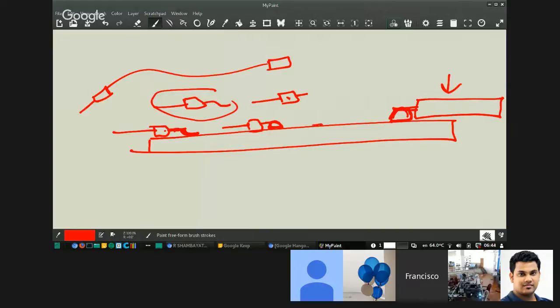And remember, if this is the pad and this is the component, never do what some people do: they solder it like this. Never solder it like this. It will last very little time, because when you force it or pry it, this will go up, and the traces will destroy everything. So never solder anything at an angle. Yeah, but what about through hole? Don't make it through hole. Make it as flat as possible.